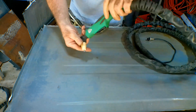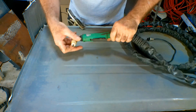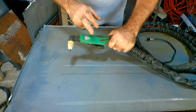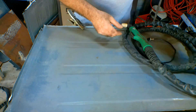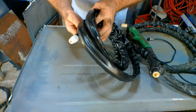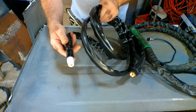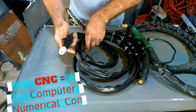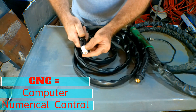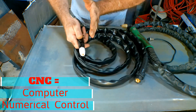Obviously you can't use the same torch like this for a CNC because it has to point straight down — it just won't work. What I'd recommend is the same style torch as this, but you get it in a pencil version — or I think they actually call it the CNC version, which would make more sense. It uses exactly the same consumables and it's exactly the same torch, but it's just a straight pencil-style torch.